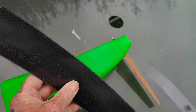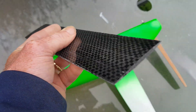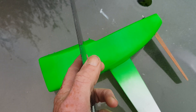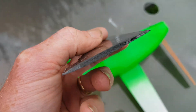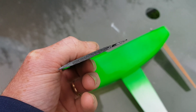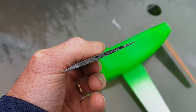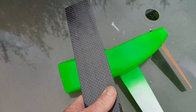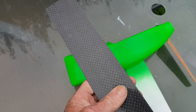And we've made a carbon fin. I've spent a week making a mold for it — two layers of 200 gram carbon cloth sandwiched between some foam. It's about six percent thick, so about three mil thick and about 50 mils wide. It's just the first one out of the mold; the mold needs a bit more work, but yeah, pretty happy with that.